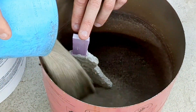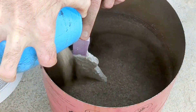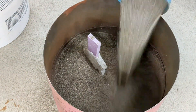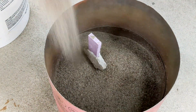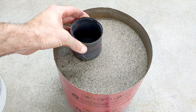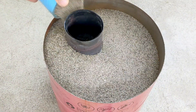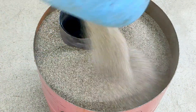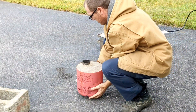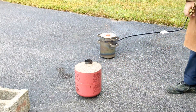This process is by far the easiest way to cast metal. You take your piece of foam, put it in a metal container, and fill it to the very top with dry sand — that is the most important thing: the sand has to be dry. Once filled, put a pouring cup on top surrounding the foam, then fill it all the way to the top so the additional sand holds the pouring cup in place. Now it's time to check on that copper.